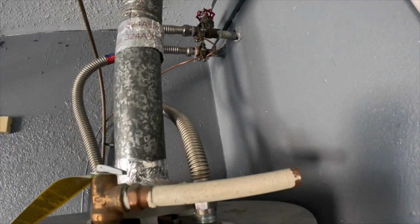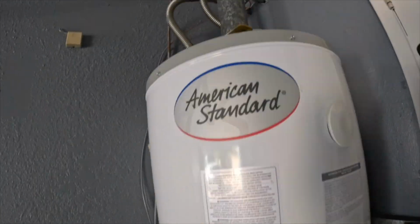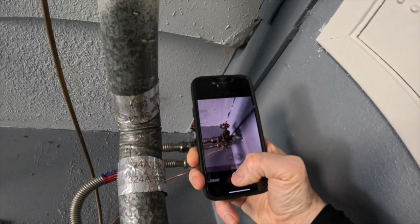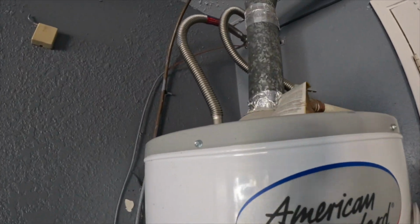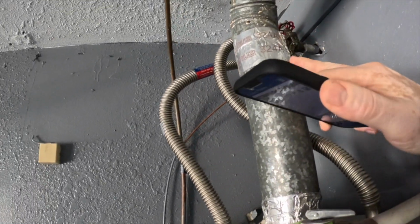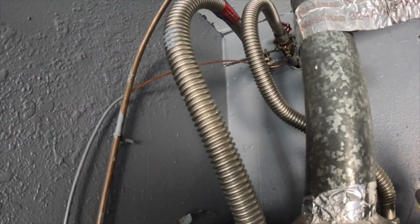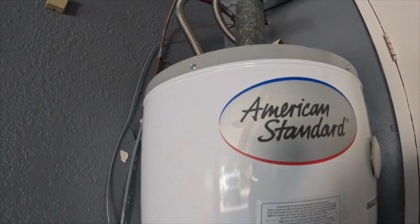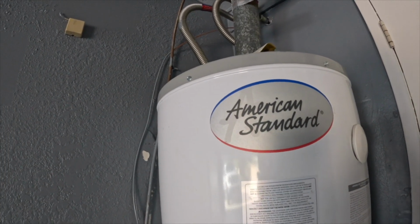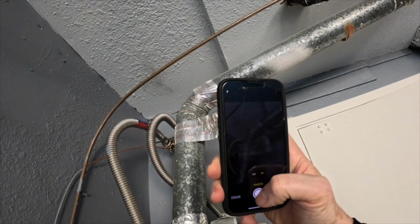That way you don't have to do the report, take pictures, go home, and then spend another 2-3 hours doing an inspection report. So right here I looked at the main water shutoff for the water heater. That's a gate valve, so that's an older style valve. I do recommend installing a ball valve. We have the vent flue single wall that has loose tape, so I'll note that. Missing screw at the draft hood, a little bit of moisture damage at the hot side of the water supply pipe.